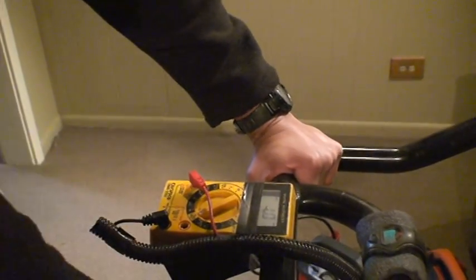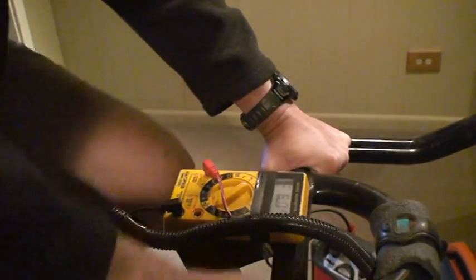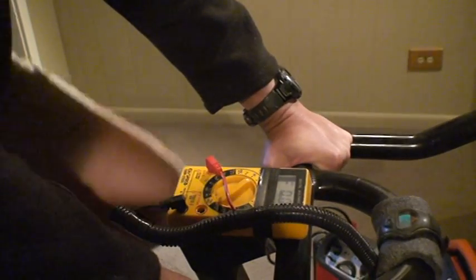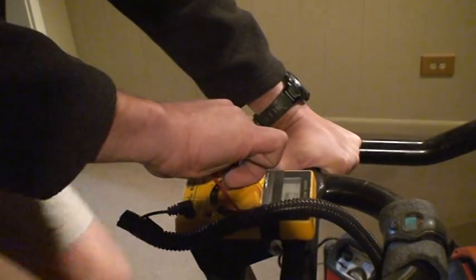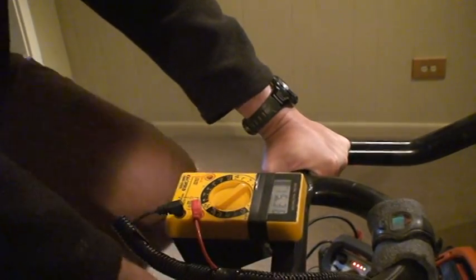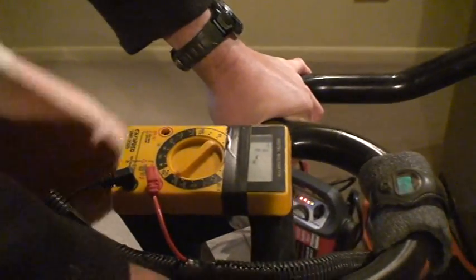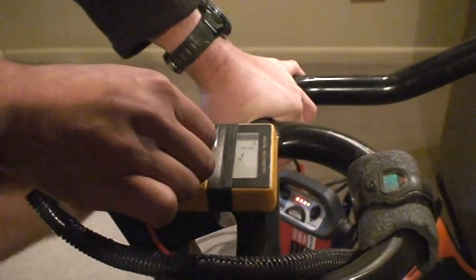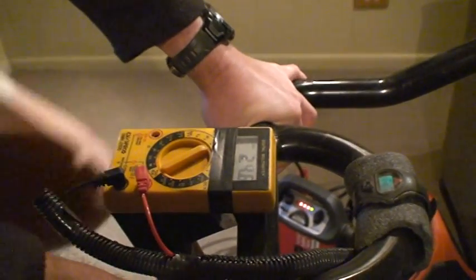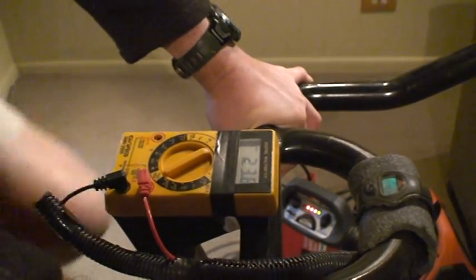With this battery pack I'm also doing about one amp, but it's likely doing it at a much higher voltage. And yes — so now I'm over 20 volts, around 24–25 volts. This one has no regulator, so the voltage climbs freely with pedaling speed.